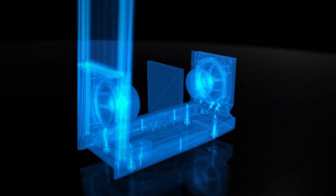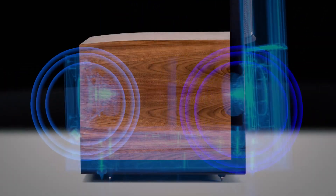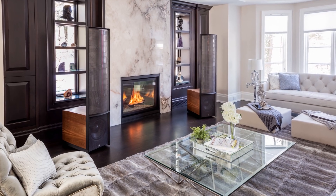The top three models — the Renaissance, the Expression, and the Impression — integrate a myriad of bass technologies to keep up with the stat panel. These products have Force Forward Bass technology, steering the bass towards the listener and away from the wall behind the speaker. This is done by phasing the woofers in a specific way that causes cancellation of the backward-going wave below 40 Hz, then bringing the woofers back in phase to give maximum output and maximum bass. A side benefit is that you can place the speaker close to the rear wall if needed. We've also brought a whole new generation of DSP and crossover improvements to execute Force Forward at a very high level.